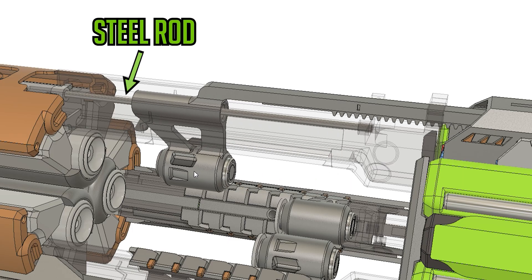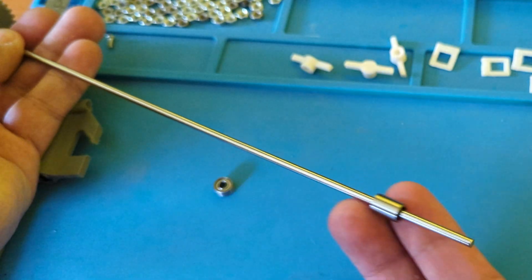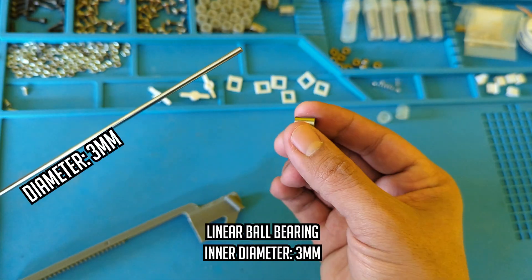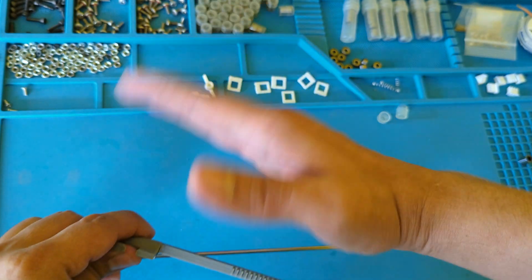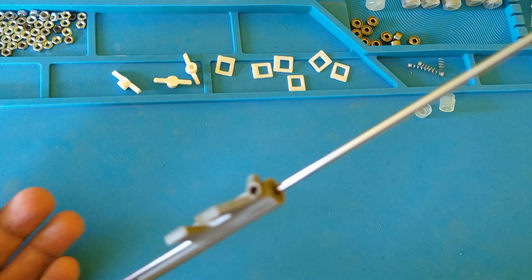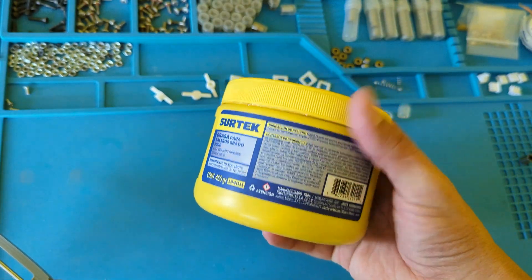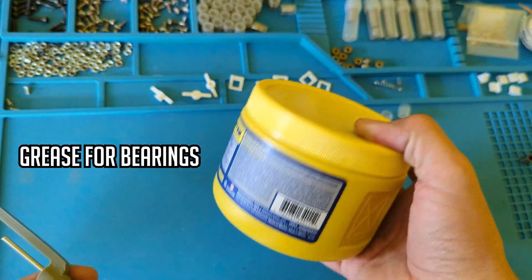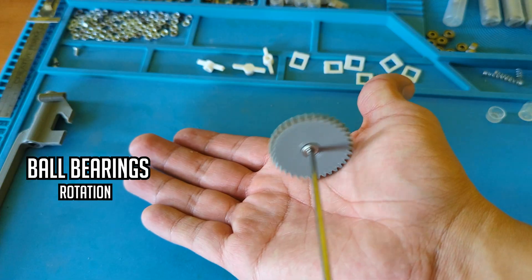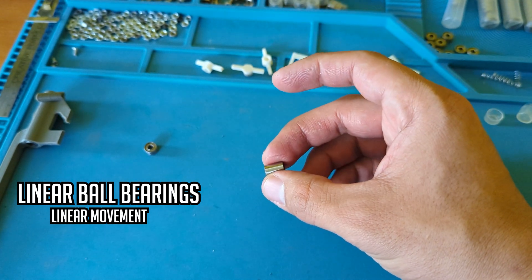This piece is supposed to slide up and down across the steel rod. For smooth sliding, I would use linear bearings, which can move up and down a rod of a specific size. I'm using 3mm steel rod, so these linear ball bearings are made for that diameter. I will use two to ensure it doesn't have any inclination. This slides without any resistance, which means the motors won't make any extra effort. In the final assembly, I will add some grease for bearings to make sure it stays that way. These are ball bearings for rotation, which are the ones for the gears that the motors have, while these are linear ball bearings for moving across an axis.